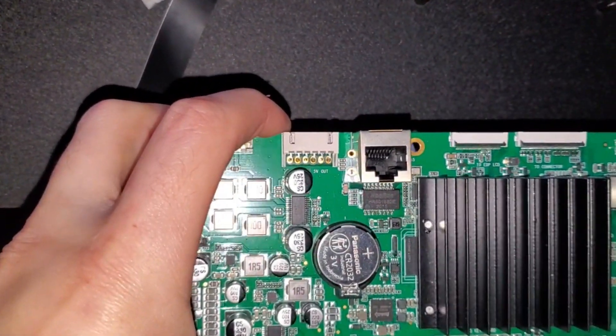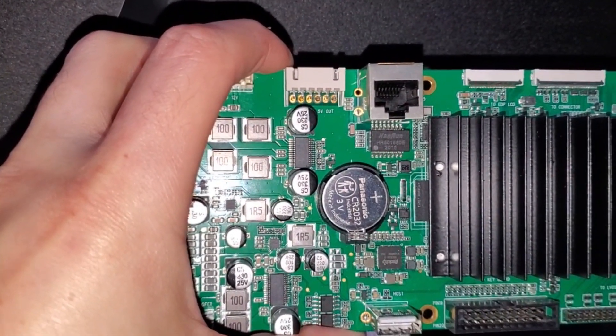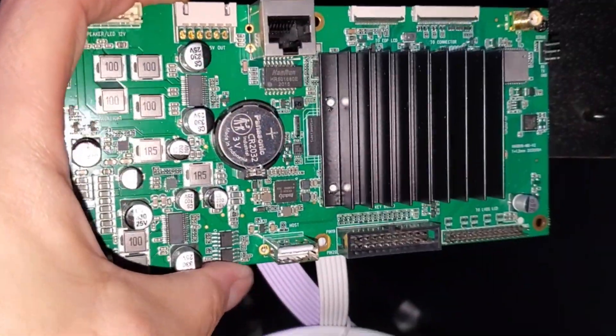You can read those voltages and see if you're getting five volts or not. You don't necessarily have to check the voltages if you don't have a meter. If you're not getting a signal to the screen and you have no audio and no video, but you do have glow on the screen, then it can most likely be a bad game board or bad power supply.